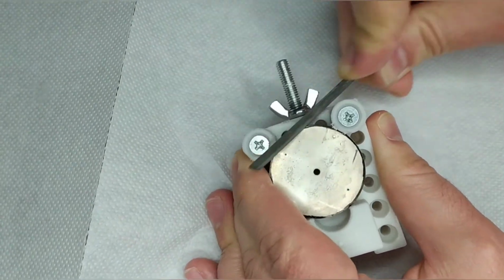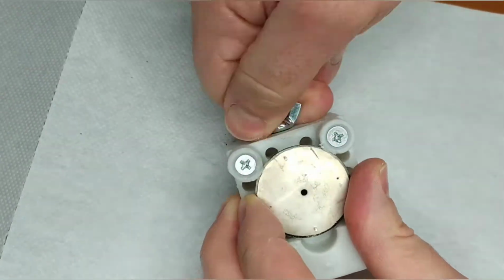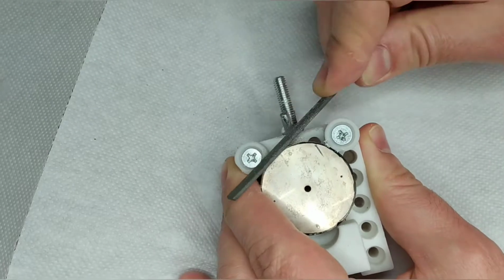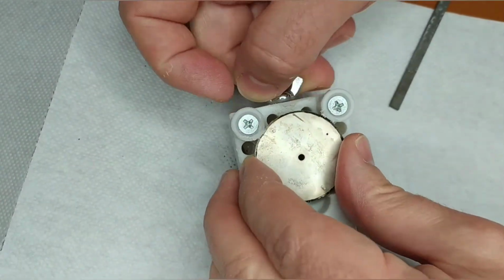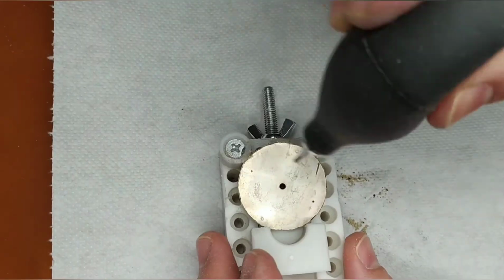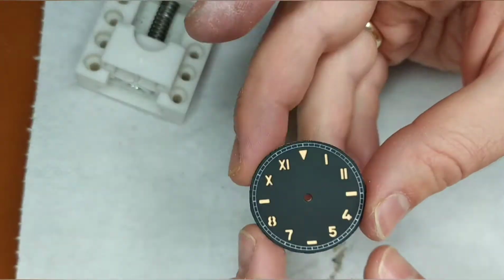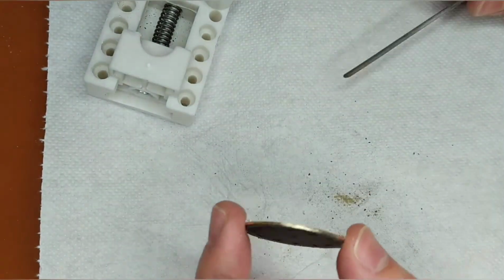Don't forget, you have to keep the dial curve as round as possible. Also, you have to clean the surfaces with the wind blower, as the trims can damage the dial face. Check the roundness and the current size of the dial as often as possible. Finally, don't forget to clean the trimmed edges of the watch dial by moving the file always from up towards down.